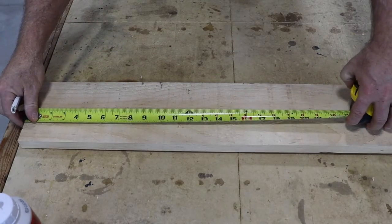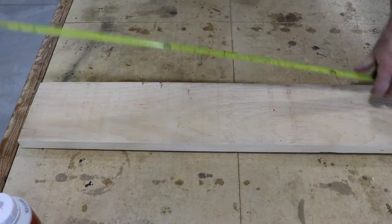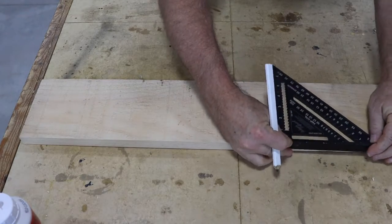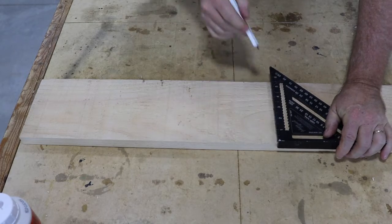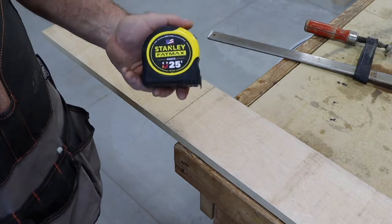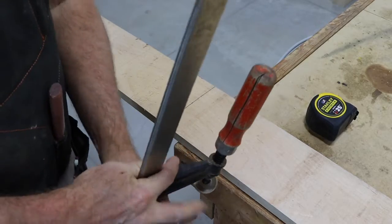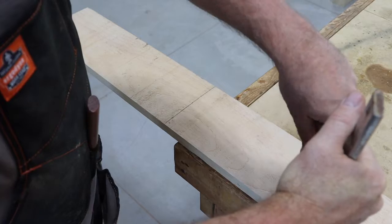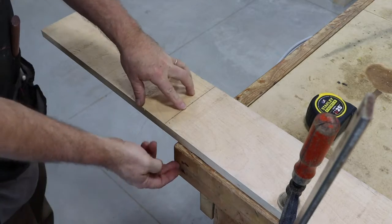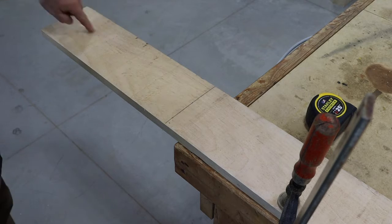The backboard is going to be 18 inches from the very end. Take your square, put it across the board making sure the back is nice and tight against the wood, and draw yourself a line — that's where you're going to cut. You also need a measuring tape. It's not a bad idea to have a clamp to hold it down if you're by yourself, though you'll be working with a partner. Make sure the cut line is very close to your support, so the wood doesn't bounce around and give you a bad cut.